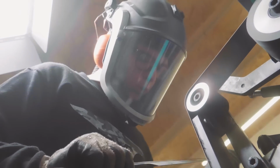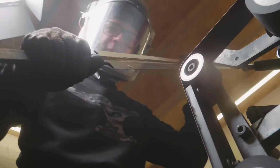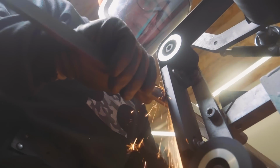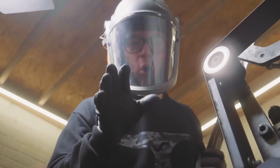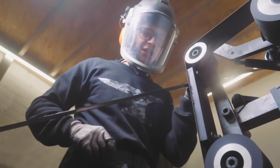When you've got a hard blade, it's super, super difficult to do all the stock removal you need, so I always have found it very helpful to reduce that surface area contact. And that goes all the way back to learning about blacksmithing with Brian Brazil, where the most taught concept was that of reducing our surface area contact with a hammer or with an anvil to move the metal faster. Applies here at the grinder too.